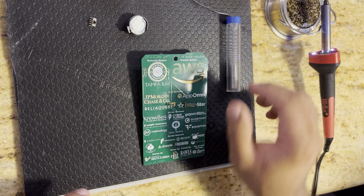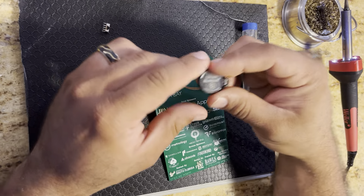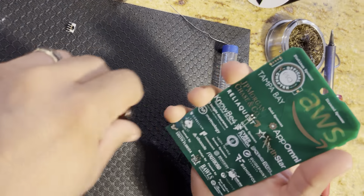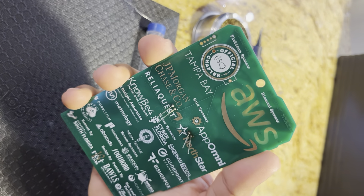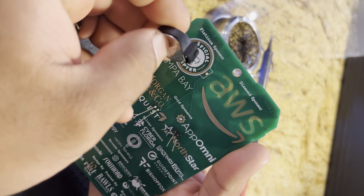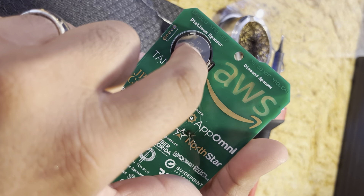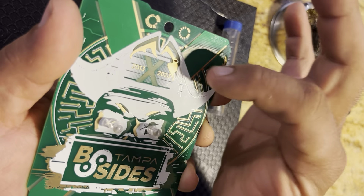Positive and negative is important when it comes to LEDs. If they're regular lights, that doesn't matter. This is your battery tray and it can also be installed in either orientation, so if you install it incorrectly your LEDs won't work. If you look at this board, you'll notice a white box outline right here, and that outline matches the battery tray with this little blocked-off section. So if you install it this way, see how it matches up — you want to make sure that matches up so your positive and negative polarities are correct. Then on this side you'll see the leads pop out, and we'll solder these two points as well.